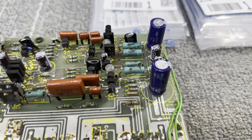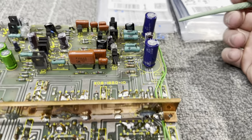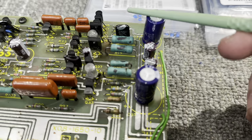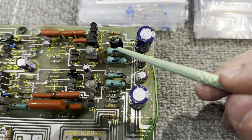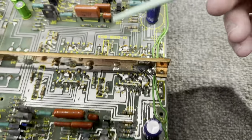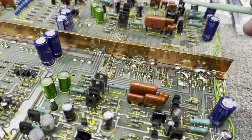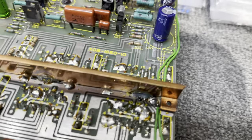You can see that Kenwood kind of dropped the ball here in terms of these capacitors. These things are really susceptible to heat. And you can see that they have them just right up against the dropping resistors that they use on the circuit board. And these things run hot. So I'm surprised that this preamp worked at all and didn't oscillate when I got it, because I'm pretty sure these capacitors are all junk by now. A lot of them are next to transistors which run hot, and like I said, dropping resistors.